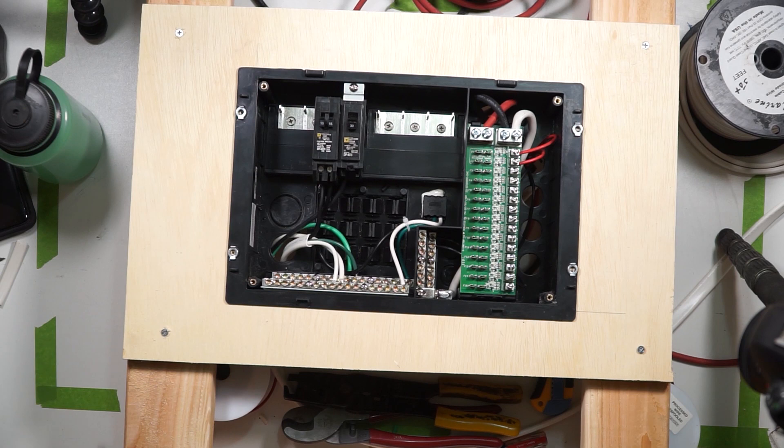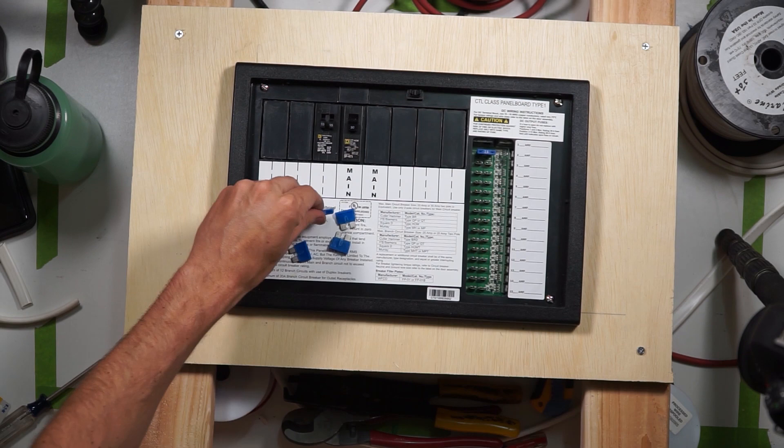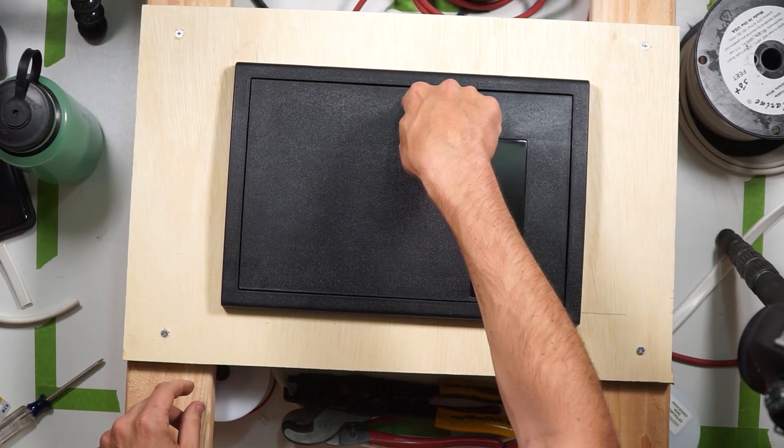Now you can insert screws into the box that hold it to your cabinet or wherever you're mounting this. Reinstall the trim ring starting with the top two screws. If you haven't done it already, you can install your DC fuses — they just push into place exactly the same as the ones you'd find in your car. It'd also be a good time to label those various fuses for what they go to. And that's all there is to it. There's more information and resources about this process in the blog post which you may find handy. If you have any questions be sure to leave them in the comments below, hit that thumbs up if this was helpful, and subscribe if you want to be notified when I make more videos like this one.